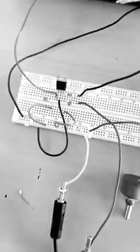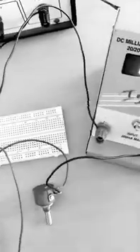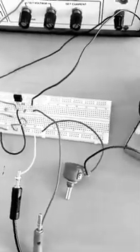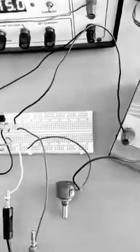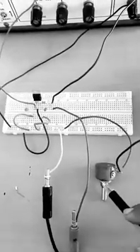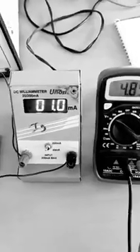The remaining portion is now connected. Pin 3 is connected to the 100-ohm resistor, then to an ammeter, one end of the ammeter is connected to the potentiometer, and the potentiometer is connected to ground. The procedure is: we will change the current value by moving the potentiometer knob, note the current and voltage values, and measure the resistance of the potentiometer to calculate load regulation. The input voltage is kept at 15V.